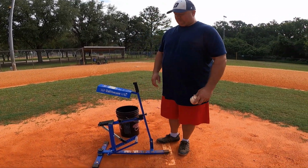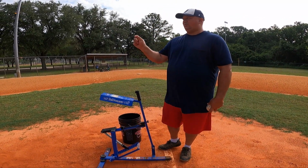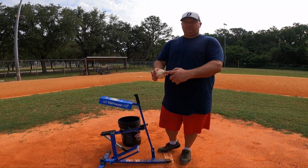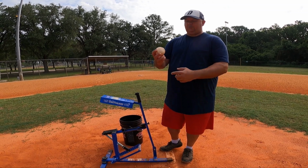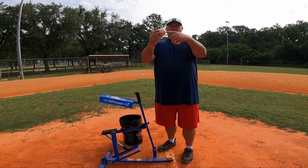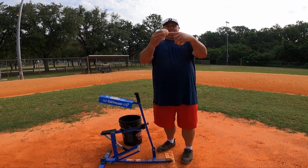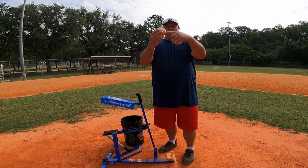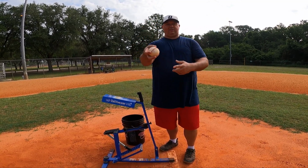The final adjustment machine is what they call the micro adjuster, and that's the one we make adjustments on the fly during games. Little League standard says they want logo side up on the ball, so you find your logo on the ball, and I'm going to try and put that pin right there on the ball, dead center. If the machine is throwing really low, if you simply rotate the ball just a little bit, where that pin hits, it's just like throwing a curveball.